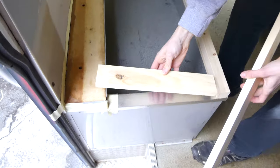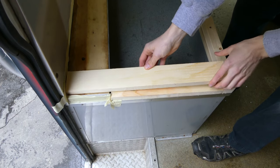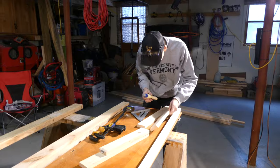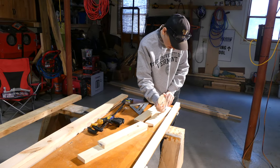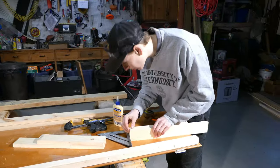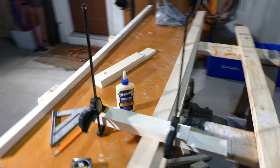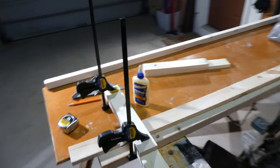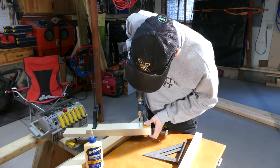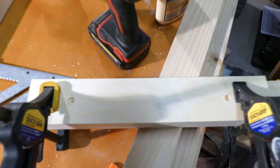This is supposed to fit just like so. I then glued and screwed these pieces together to create the flat surface I needed. This is not necessary for every application - as long as you have an even surface. I use counter-sunk holes here throughout the build. This makes for a very clean aesthetic so nothing gets caught or ripped on screw heads or splinters.